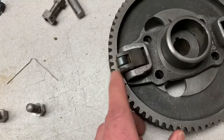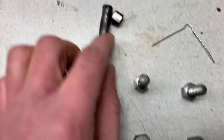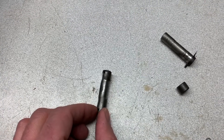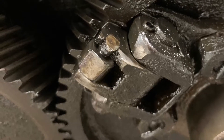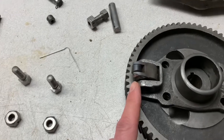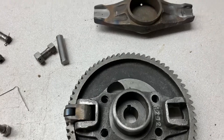The rollers that were originally fitted in these dogs were flat spotted — bad — like it hadn't moved in years. The pins that bushed it, you can see the wear; this thing looks not straight. On top of that, one of the ears was completely broken off. So I had my 87-year-old machinist cut the ear off, re-weld a new one on, locate it with the other tab that was left, make new rollers, and repin it — basically rebuilding all that stuff. It was pretty worn; it's going to be a job to get it all back together.